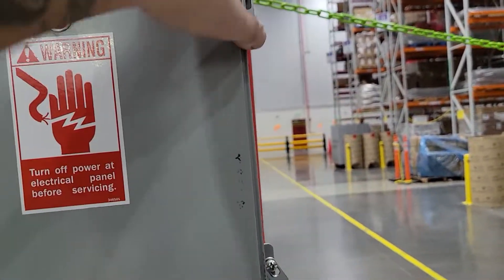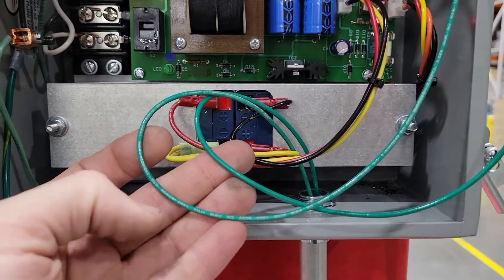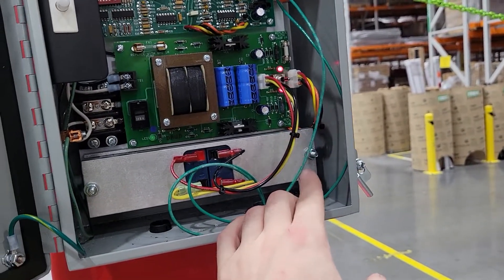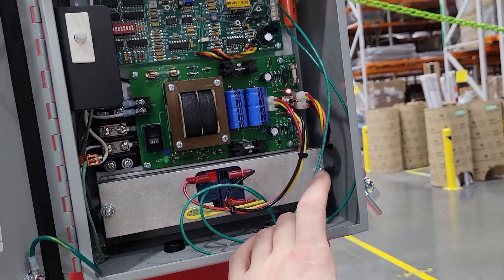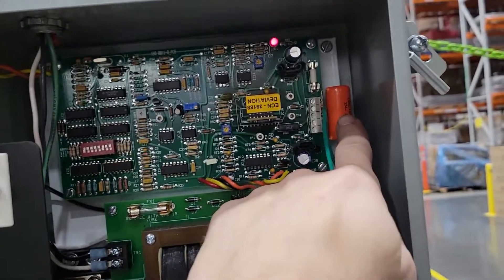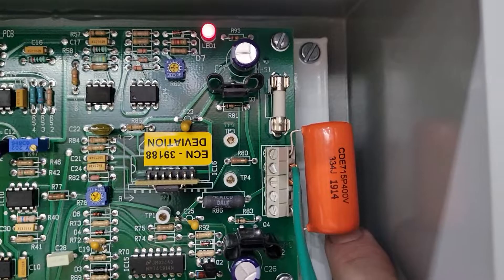Let me open it up one more time. Here's the antenna wire — that's just copper, just a piece of wire. This loop is unspliced — you can splice them, but this is an unspliced loop. On this particular run it's about 4,500 feet, so almost a mile. On your longer runs, they have you put in a capacitor — I'm not sure if that's for current limiting, but on the longer runs you definitely have to get that sorted out.